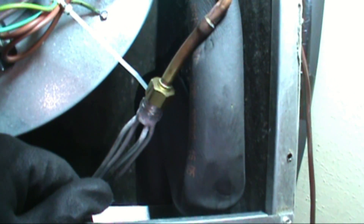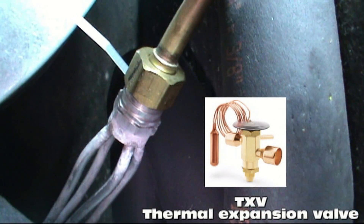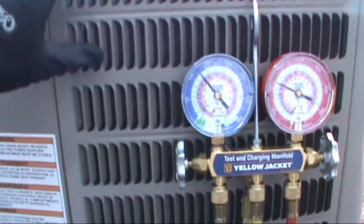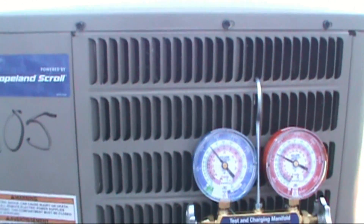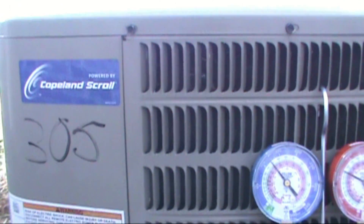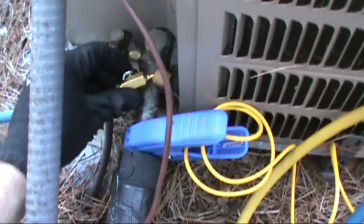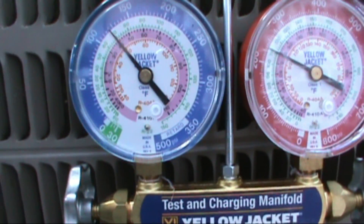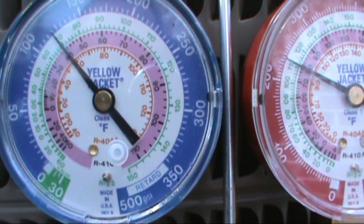Before you charge a unit, go to your air handler and see if you have a piston — this is what they look like. I'll post a picture of a TXV also so you know what it looks like. Today I'm going to be doing the example on an off unit; this is just a hypothetical situation. The unit will be off because I have the door off and stuff upstairs on the air handler, so the pressures and everything would be wrong. I come down here, I know it's a piston, so I'm going to be charging by superheat. I put my gauges on — blue on the low side, red on the high side — and let it run for about 15 minutes, then get my pressures.